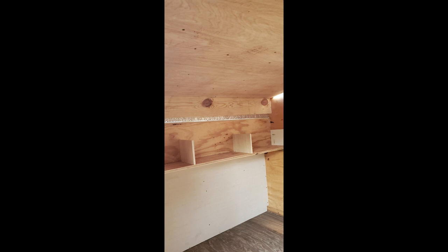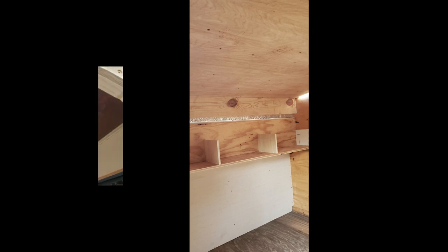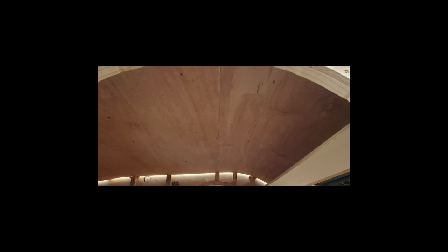With the spars and their support in place, it was time to install the ceiling. Everything ended up being screwed into the ceiling. When I tried to do nails, all I had was 18-gauge nails for a nail gun, and unfortunately they just pulled straight through the plywood. So we ended up using screws — not very sightly, but it will all be covered up later. Between the plywood and the spars there is also a layer of Titebond glue to help keep everything in place.